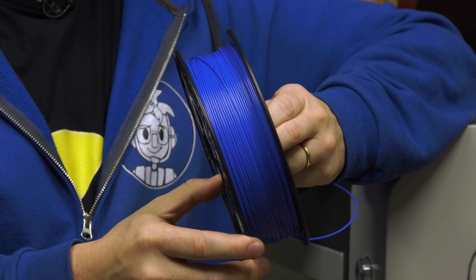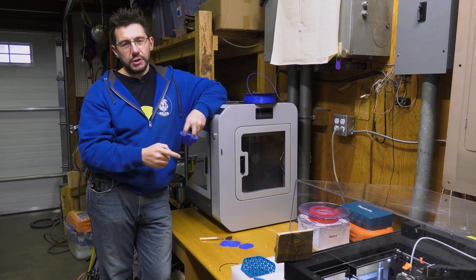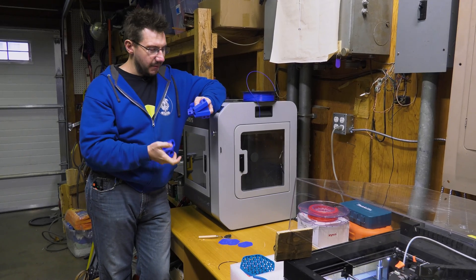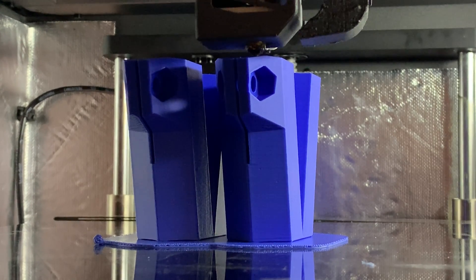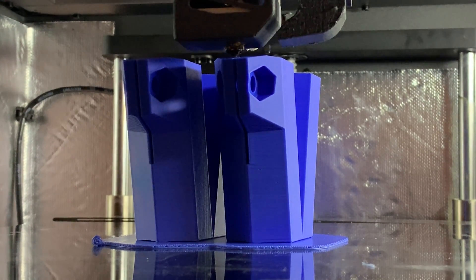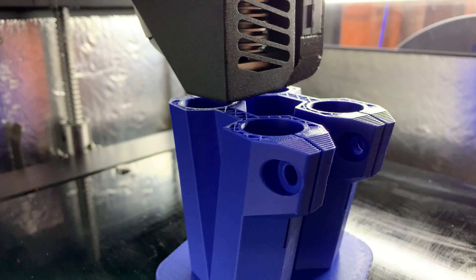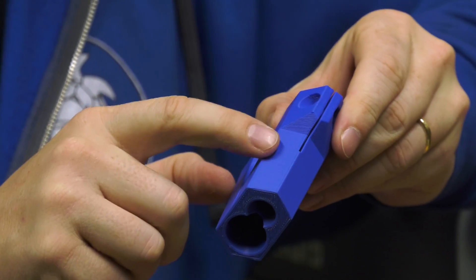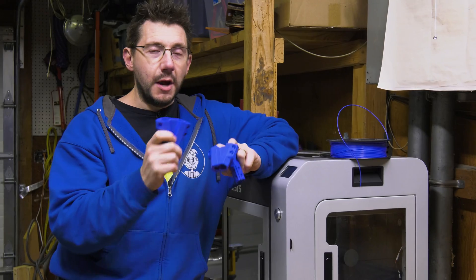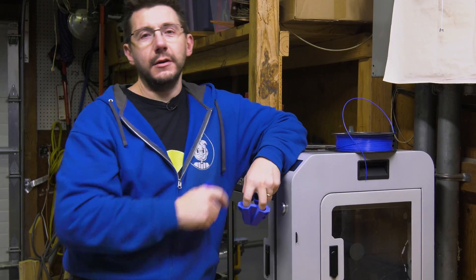Of course, I'm moving this over to the high-temp stuff, but before I did, I had the 3DX Tech ASA filament already loaded. As we know, ASA is much like ABS in the way it prints, but it is resistant — it resists UV, which is what the sun gives us, albeit not as much here in the Pacific Northwest. So ABS-like qualities, and this isn't really going to be seen outside, but it turned out great. This machine, when printing these filaments, it's almost like using a cheat code because it adheres to the bed well. I'm using the VisionMiner nanopolymer, and the chamber is heated, allowing the material to be laid down in the best way possible. These look great, but now it's time to take them to the office and give them a test.